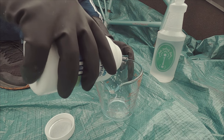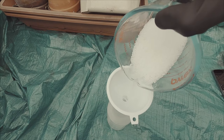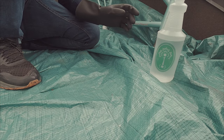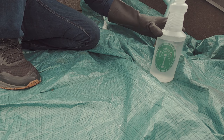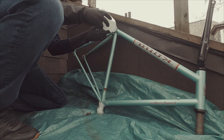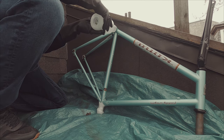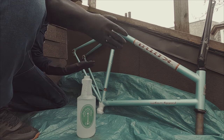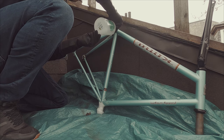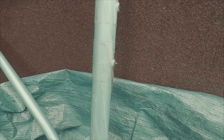For this batch, I'm using a 30% lye crystal to 70% water ratio. Another very important safety element to remember: never ever pour water into lye — always pour lye into water. If you pour water into lye, you risk causing a violent reaction and end up covered in this stuff. Once the caustic soda gets hot, you can start pouring it down the bottom bracket shell. Pour only a little bit at a time, wait a little bit, then pour some more. Only mix about half a bottle — it's a lot easier to handle and will minimize spills. You can really see here why you should not be doing this without gloves. Eventually, the caustic soda will react with the aluminum, and you will notice some smoke and even the caustic soda pouring out of any openings in the frame.